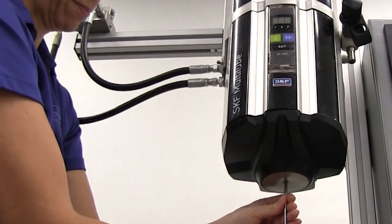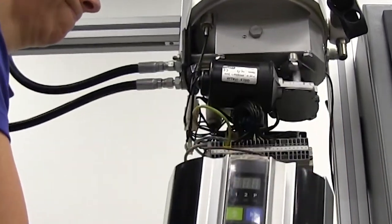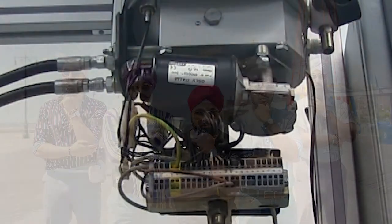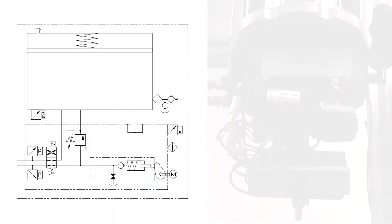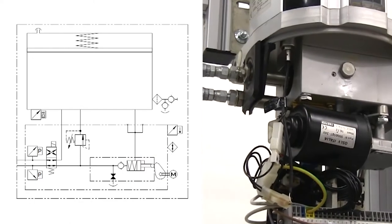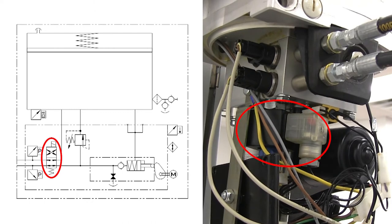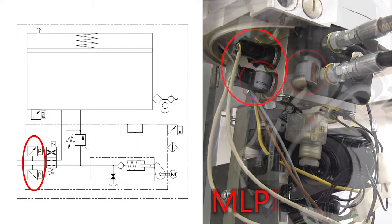However, you can loosen a screw on the bottom of the unit to remove the cover from the bottom portion, which will reveal the good stuff. Quantum's engineering team made a schematic to help understand what's at work inside the control unit. There's a small electric motor located here to operate the pump. To control which outlet port is selected, a two-position, four-way directional control valve is provided, which is located here. To measure the pressure on each outlet port, a pair of pressure sensors is fitted — here on the MLP or here on the MLPI. In case of overpressurization from the pump, a relief valve is fitted.